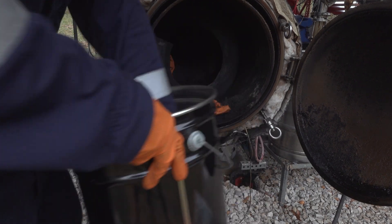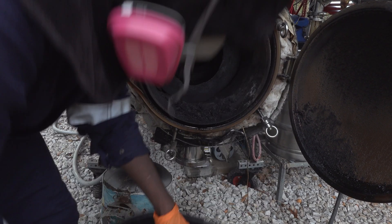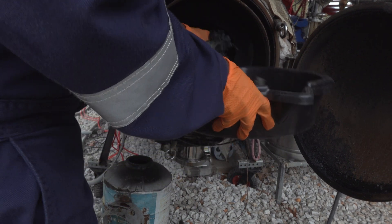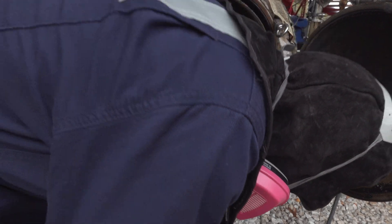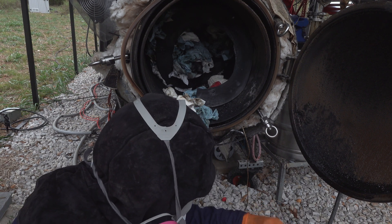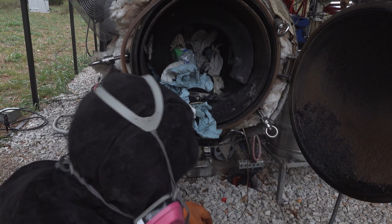I'm going to do a run with my lab waste — I have a ton of plastic to go through, but also a lot of lab waste from construction of the machine, moving it, and oil changes on my generator. All that stuff can go right in the machine and form fuel. That reminds me — I'm working to get my outputs analyzed, and to do that I need to do runs of every individual type of plastic: just plastic water bottles, probably polypropylene bottle caps, just plastic bags as LDPE, just milk cartons as HDPE. I've got to do that so the analysis is accurate with proper controls, instead of just random mixed runs every time. But right now I'm doing these runs to get a large quantity of oil to test my distiller and test the natural gas. I'm still optimizing things.